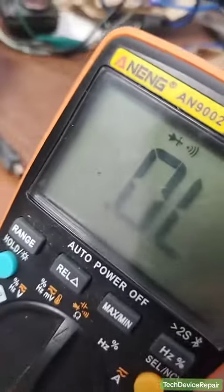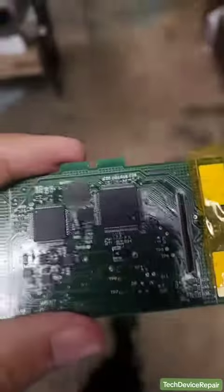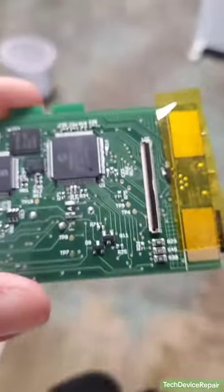As suspected, it's back to an open line — it's weird. Removing the LCD screen just to make sure and it's still open. I'm going to go over the legs one more time because that's where it connects to the power on that small resistor. I ran those through one more time and the multimeter is reading good right now, so let's go test it.